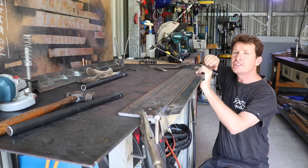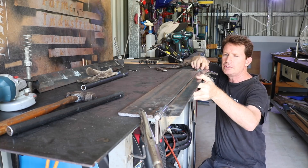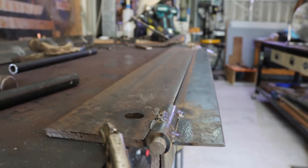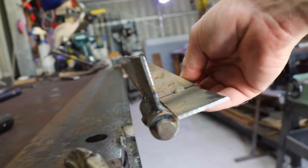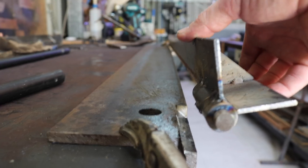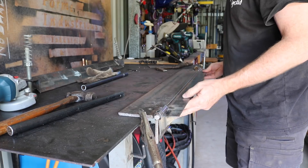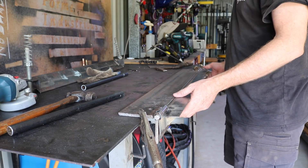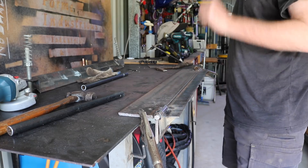A little bit of confession time. As I welded these hinge joints up yesterday afternoon, they were slightly misaligned, and I put the handles on to try and lift it up and cracked this weld off. Now I can see why — the hinges aren't perfectly parallel. I thought they were parallel because they were sitting in this plane, but they're obviously not. I need to grind this weld off and fix that up.